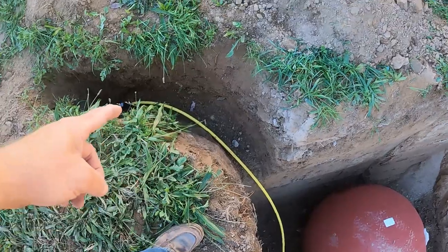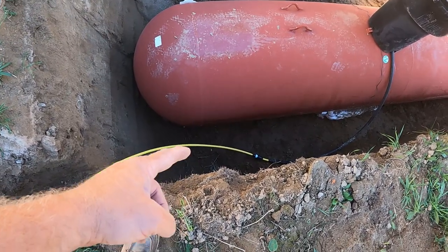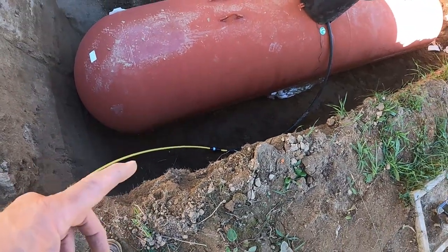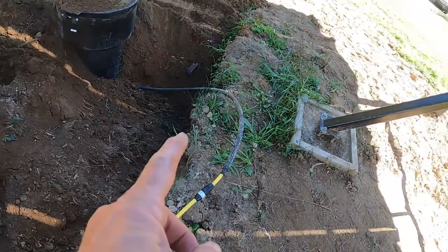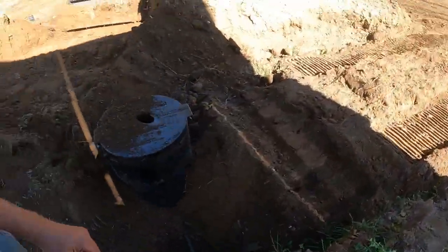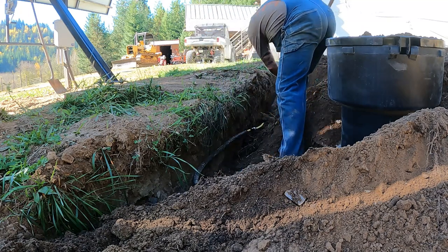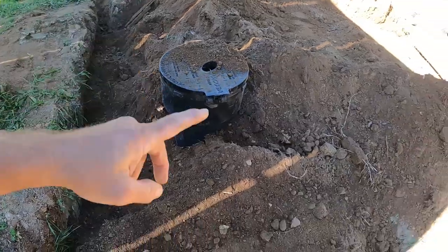The line needs to be 18 inches deep, which is where it started off. But the hole is down here, so I don't want to have to dig all the way down if anything were ever to happen. I'm going to pull this line up out of the way, backfill this first until I get it about the same level as the trench, and then put the line back in and finish backfilling. I've got it pretty well backfilled — making sure this is at 24 inches — and then I can finish burying this thing.